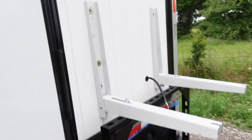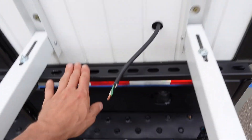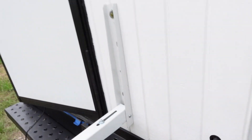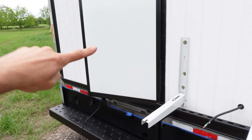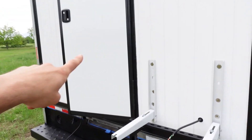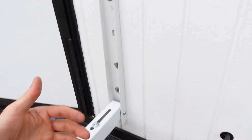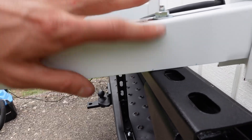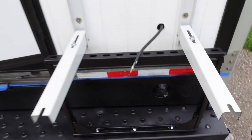Got the bracket all mounted up in place. This little frame I built is going to carry most of the weight of the mini split. Traditionally, all the weight would be pulling on the brackets and then on the roll-up door, which I already cut a big hole out of to add an entry door. I knew the roll-up door isn't super structurally strong, so with this frame here and the brackets resting on it, all the weight from the mini split transfers down onto the frame.